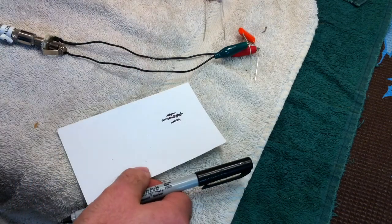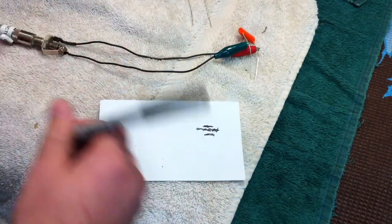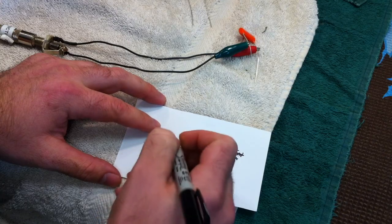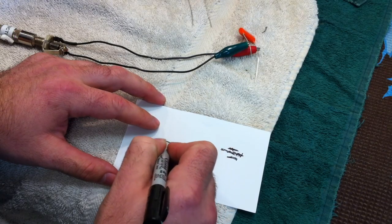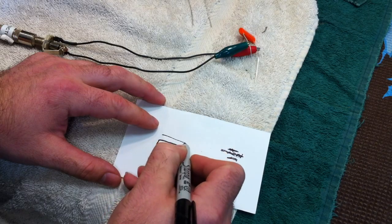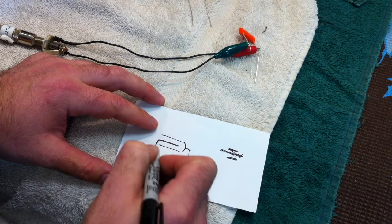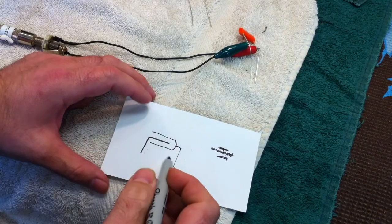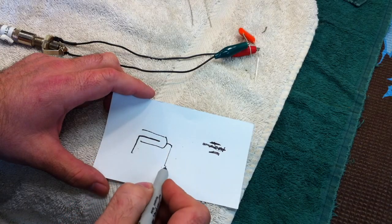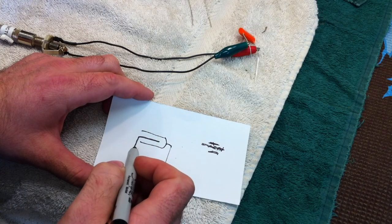The difference between that little plate capacitor and these orange drops is how they look inside — it's drastically different. On one side, you've got a lead that just comes in and kind of hangs out in there. But on the other side, you have a foil layer that is connected to a lead. If you are familiar with the way that coaxial wire works in a circuit, one of these covers the other — that would be a ground shield. If this side is connected to ground, this side would prefer to be hooked up to something that is a little less ground.